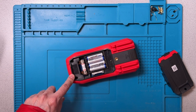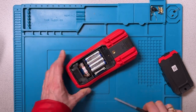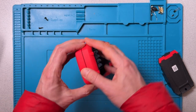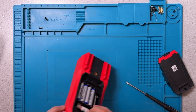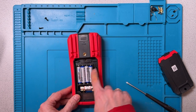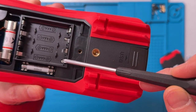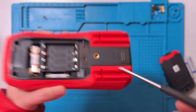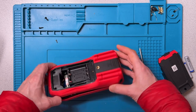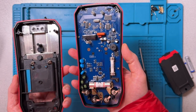So two screws down here — we'll take those two screws out and see what happens. Those two screws are out. Now let's see if we can separate the two halves of the case. The bottom is separating without any trouble, but there is something binding at the top, so I need to do a little more exploring. Maybe there are some screws underneath the fuses or the battery box. I've taken the batteries out and you can see that there's a pair of screws there, so I'll remove those next. That seems to have done the trick — it just comes apart after taking those two screws out.